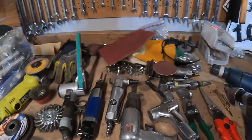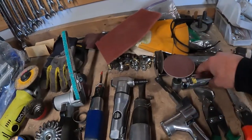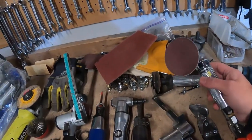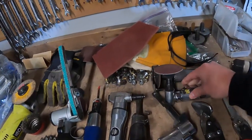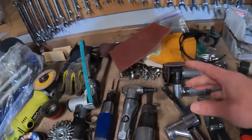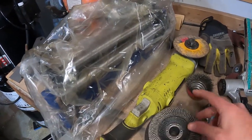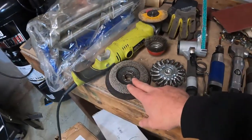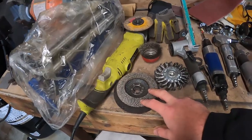Now getting into grinding and surfacing metal — the die grinder with a cutoff or sanding disc on it is very useful at $20. I use it for a lot of finish sanding. I used to use the angle grinder with the flap disc attachment, but the problem is it's a very large surface area that's not meant to get into tight spaces, and it removes a lot of material very quickly — you can accidentally remove too much.